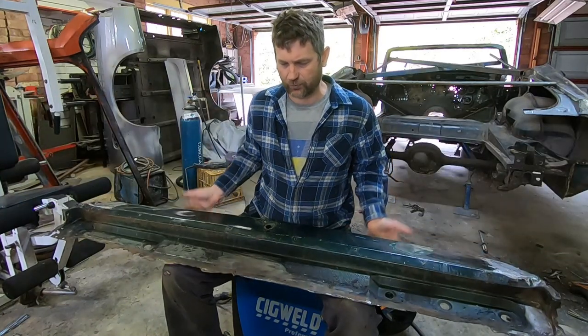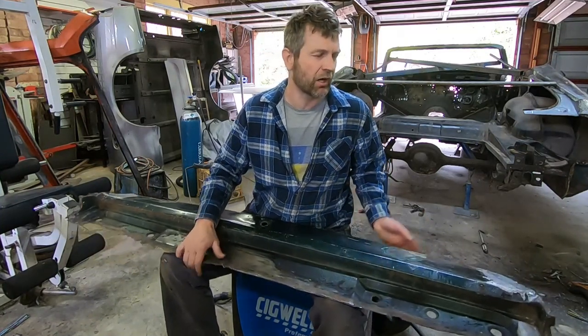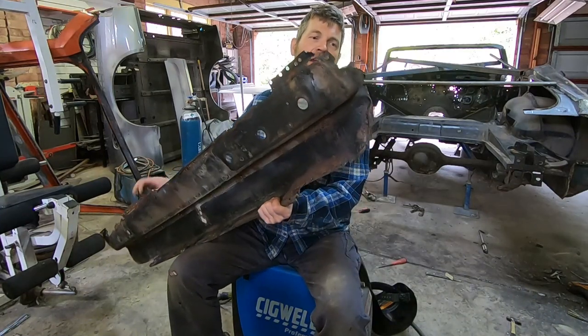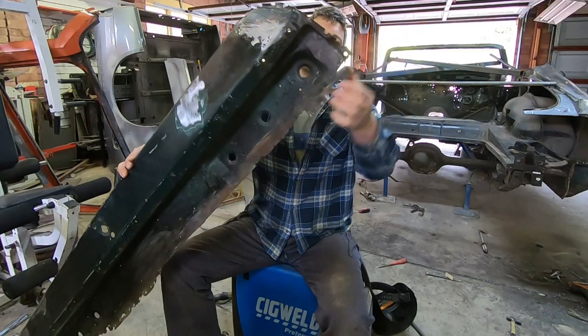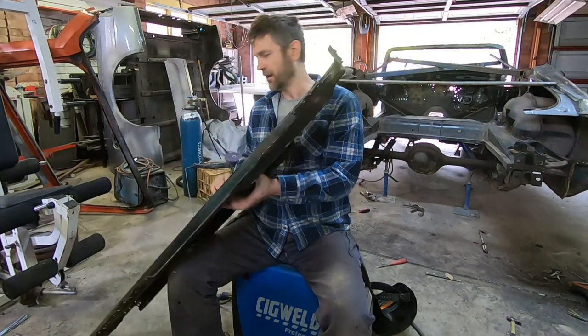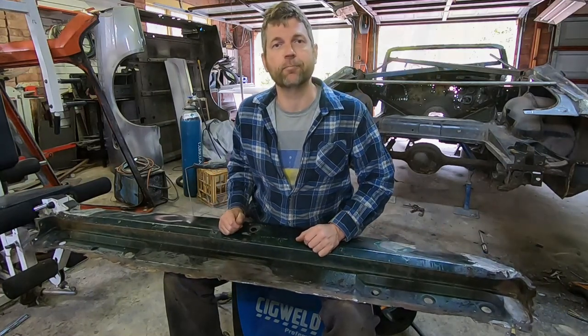We are going to repair that with a strip all the way across. It will probably buckle and warp. That's okay. We will use the English wheel and shrinker to take care of that. And of course, we've got some issues on the end. I'll flip that around so you can see that as well. And they're not major, just some small parts. So I think we'll get started with that and we'll get this whacked in no time.